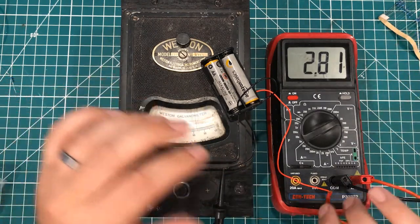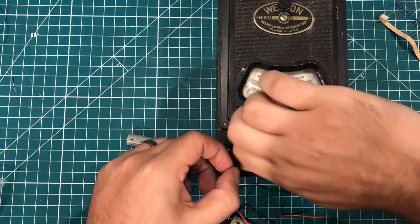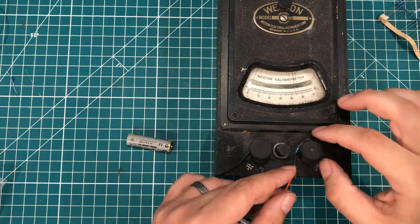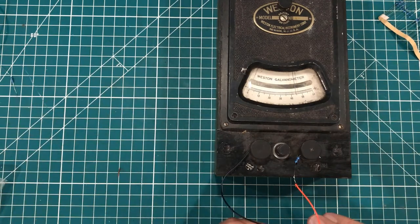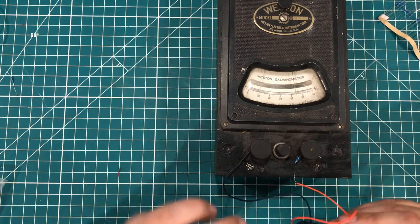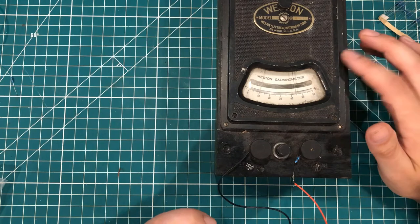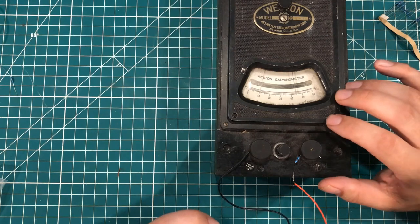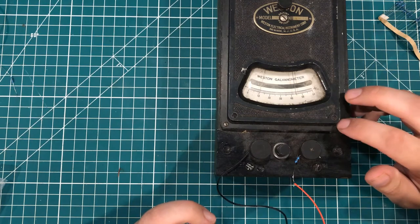Let's hook the galvanometer up and get this resistor wrapped around this pole and in contact. We are getting — it's weird the way it kind of bounces like that — we're getting around 10 microamps. This thing is about half of what I think it should be reading, so I'm guessing this thing is definitely out of spec. I mean, it's gotta be 60 years old. But it does function, and maybe I'll send this on to someone more talented than I am to do a teardown and explanation of how it works.